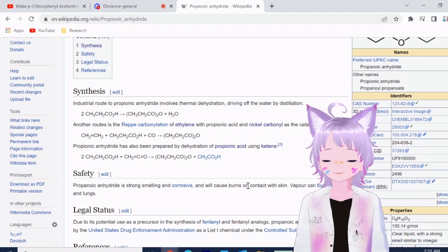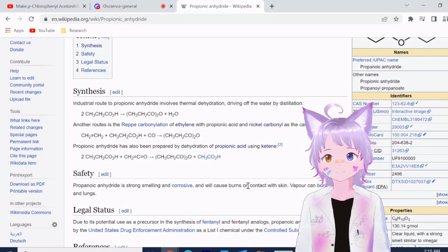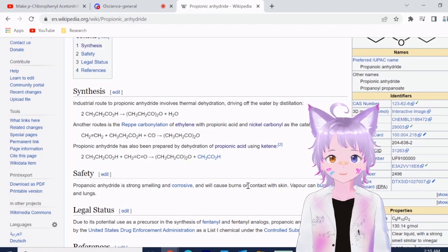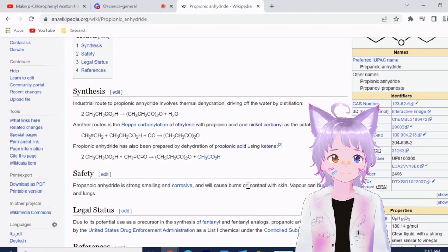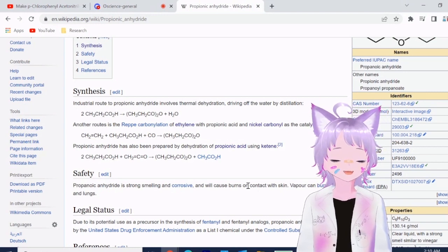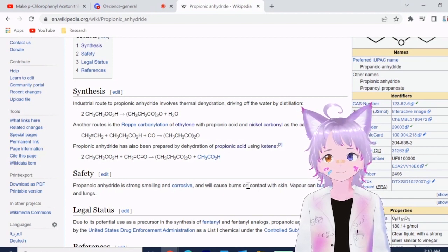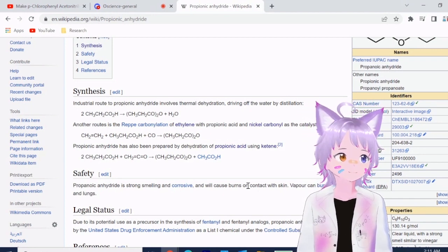You know, and then you have to have plans in case shit goes wrong, like a kill switch for the lamp and all of that, you know? And some way to just throttle the scrubber all the way. Who cares if it goes all the way to negative? It's like a purging setup. And have a one-way check valve at the inlet and another valve behind it that can be opened to purge the system safely once it's at negative pressure. I know this is sounding more like a homemade industrial setup rather than a chemistry setup where you have check valves, manometers, and scrubbers. But if you're gonna work with that, please get those things. Like, seriously, because I mean, it is safer than dying.